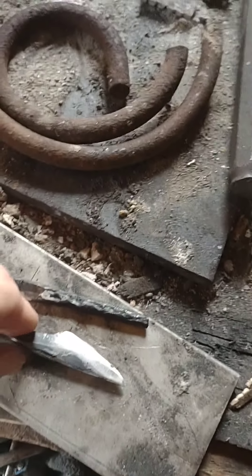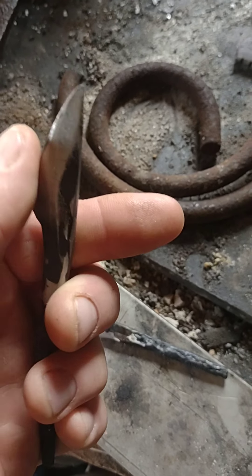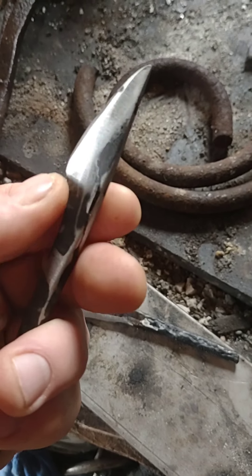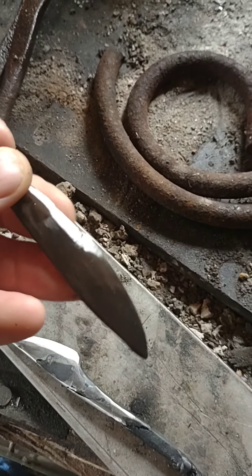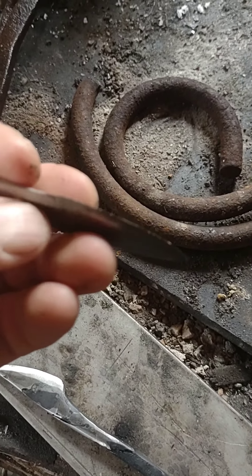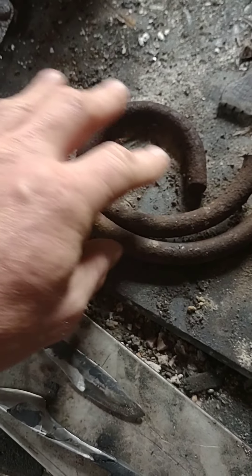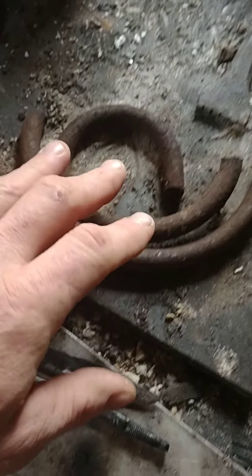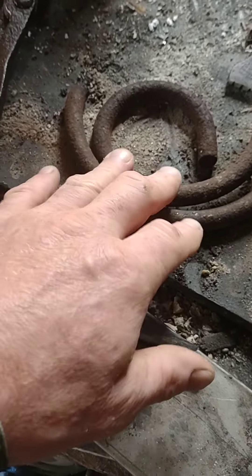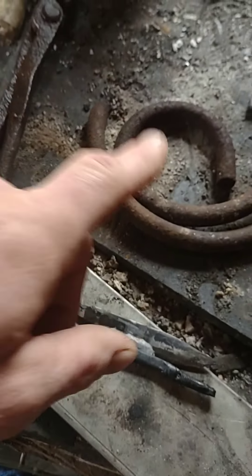Here's how it goes: I've got this little knife here, probably could be handled, it's hard and tempered, okay but a little bit short — basically a patch knife or paring knife. The main knife I was looking at just got too many cracks from grinding. So I'm going to take a couple pieces of coil spring, heat that up, straighten it out, and combine these into a good kitchen knife — straighten them out, clean them up, forge weld together, fold it over and twist it.